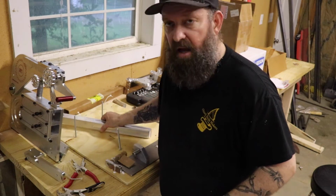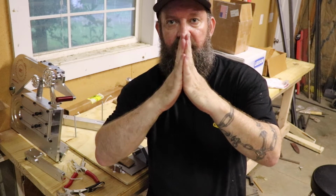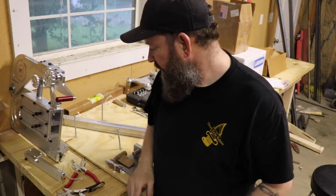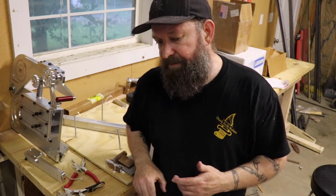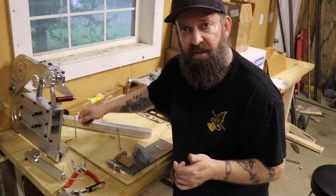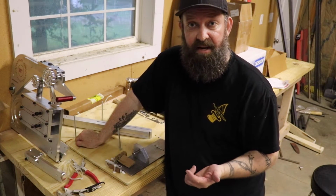And a hollow grind on a knife, if you're looking down the edge of the knife, a hollow grind kind of does this. So it kind of curves inward and then goes into the sharpness of the blade. And that's for things like razor blades, things that you don't mind if they dull a little bit when you use them, and you can just run them across a strop, a leather strop, and sharpen them back up that way.